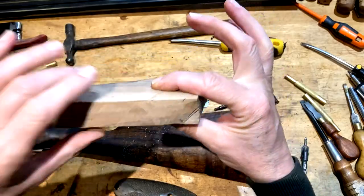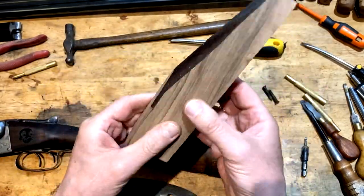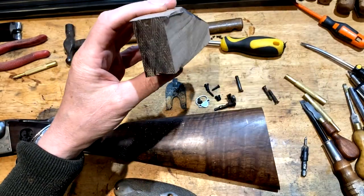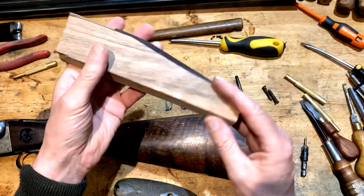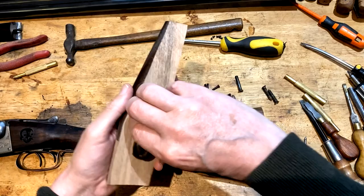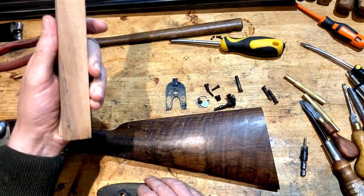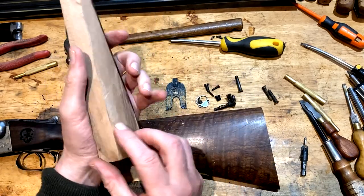That's approximately an inch. You don't need a circular saw with a big table. You can do this with a handheld Makita. That's what I use. And you can see that the form is taking shape. Now, this is an inch. I've got plenty of material. I only want 3/4 of an inch. So, you know, I can pick the nicest part of the grain